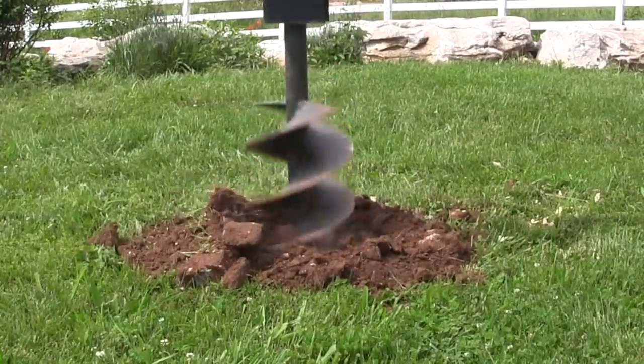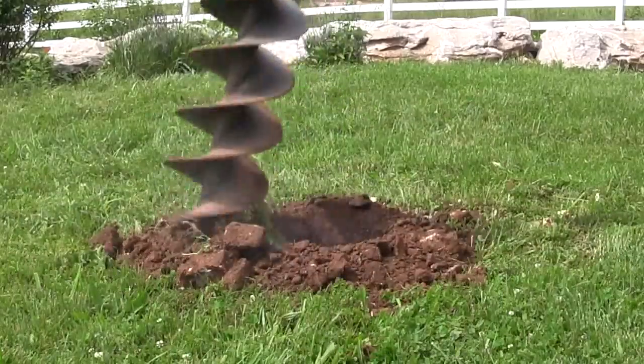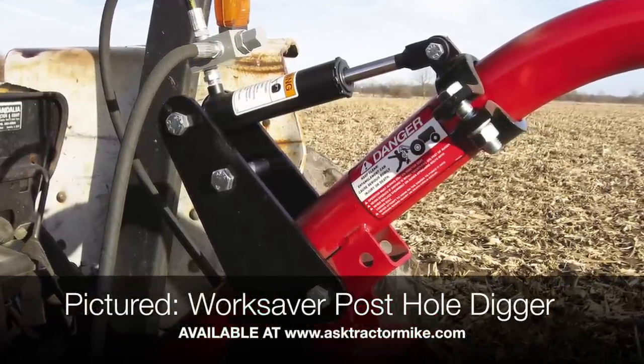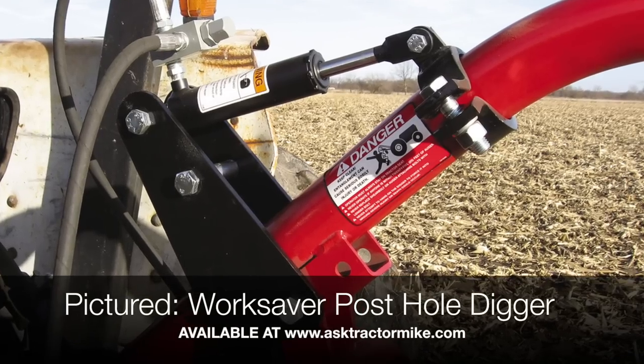One thing a lot of people invest in — and I'm not sure it's always a good investment — is hydraulic down pressure. A lot of people don't know that your three-point has no down pressure; it's lift up and gravity down. Some of the old International tractors had down pressure on the three-point, which made post hole digging easier. Usually gravity works just fine, but on some more deluxe models you can get a cylinder that pushes the auger down — you need remote hydraulic connections on the tractor for that — and it'll make a hole unless there's solid rock.